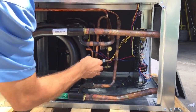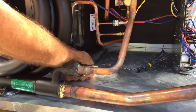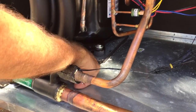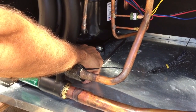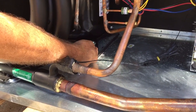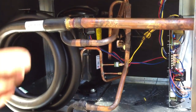If you look right here at the compressor, talking about how quiet it is — you've got a rubber pad underneath it, and then you have rubber grommets between the compressor and the floor. So you have rubber here, rubber here, and then this itself is a scroll compressor.